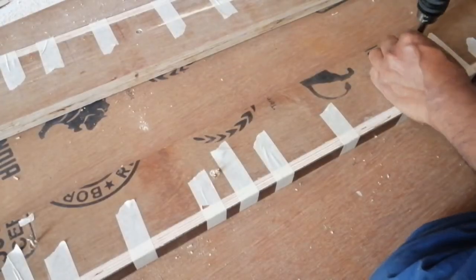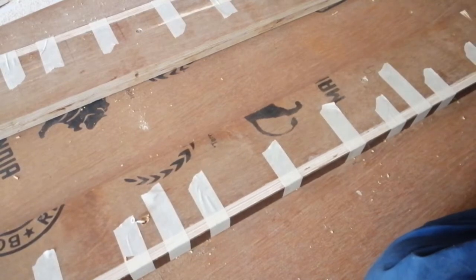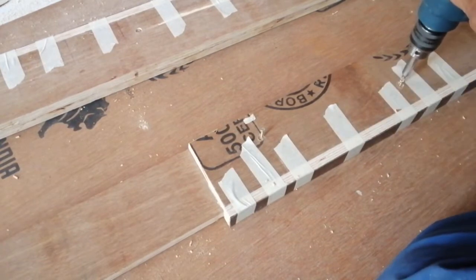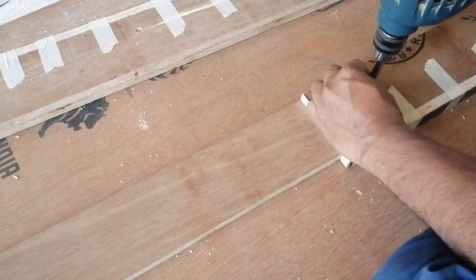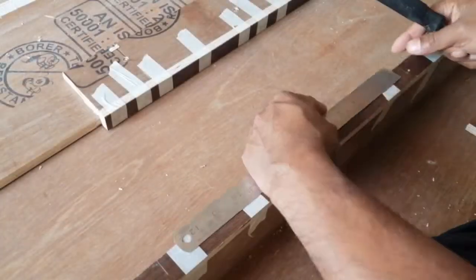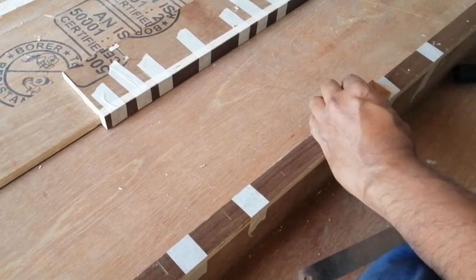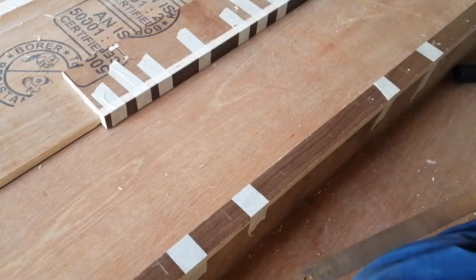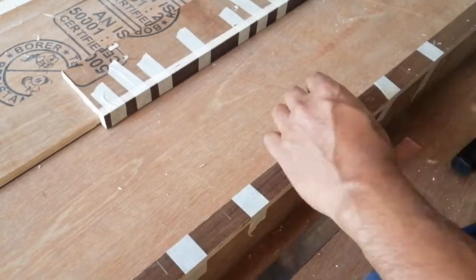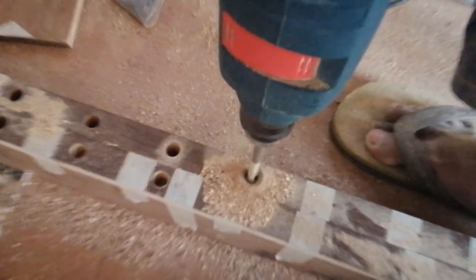Reinforce the two layers of plywood with the help of randomly screwed 1/4-inch Phillips head screws. Complete the lamination process of the inner edges before making the holes for the rods. Now let us make the spots for the holes with the help of a simple custom-made stencil. Drill the holes with the help of 12mm chisel head drill bits.